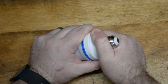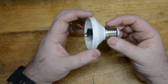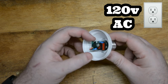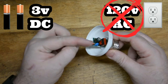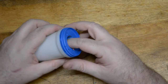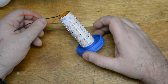When you first crack open the bulb, which comes off really easy, you're going to see this little piece inside. This is kind of the crux of where a lot of this happens. We're not going to use this in the project, but it's important to understand. This whole thing is set up for 120 volts from your wall, but this piece reduces that voltage, converts it from AC to DC, and breaks it down to three volts. You don't need the 120 volts — you just need three volts, which is why we can use two AA batteries. So this piece, you don't need at all. When you open it, cut those two wires right where they are and get rid of it. The top piece also comes off — and this is the guts of the piece. Pull these wires out to make them accessible. Don't detach them, just pull them out.